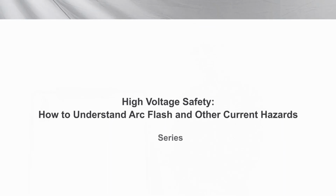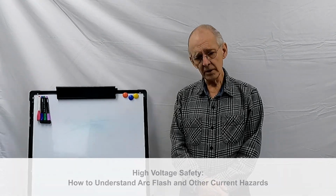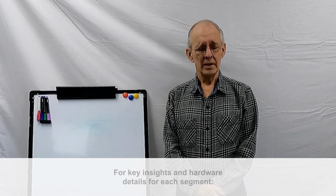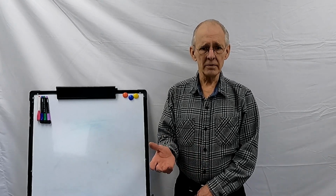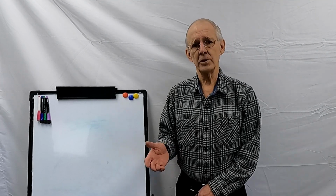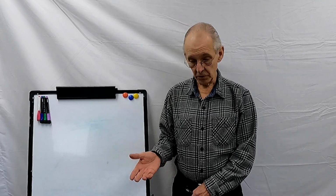So today I'm going to talk about electrical safety when you're doing control work. The deal is that 240 volt electric is, in relative terms, very safe compared to 480. You say, oh, what's the big deal? It's only twice the voltage. Well, in between 240 and 480, a lot of things happen. At 480 volts, which is 277 volts to ground, you get into things like ionization of dust particles and stuff like that that can cause a flashover.